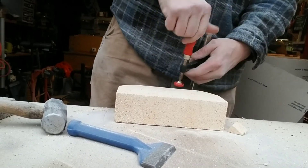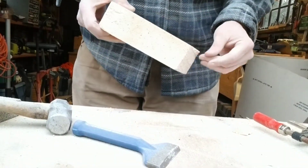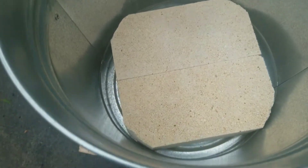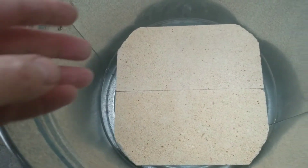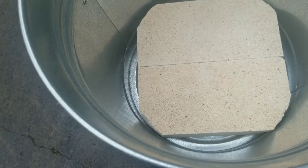Once you're done with all the grinding, check it out — does a pretty good job. Next, you're going to dry fit them in here — that works pretty good. I'm going to put a circular piece of Kaowool at the bottom for insulation; this will be the part that gathers the heat. Then I'll pack this area with refractory, and that should give us a pretty good base for the crucible to sit on.